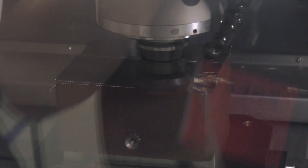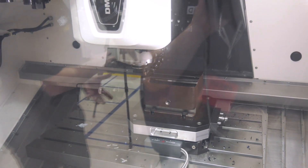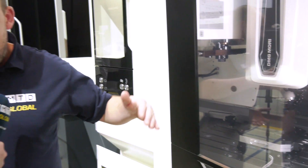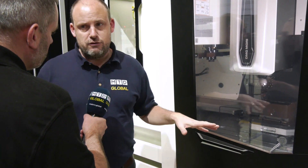The X axis, as you'll see moving here, is actually the only axis moving left to right. They're not stacking axes on top of one another. On some VMCs you'll see a Y axis on top of an X axis, and when you're moving the material you're having to move it on two axes. Here, by the fact that the X is just moving left to right with no other axis stacked with it, it's a more stable construction.